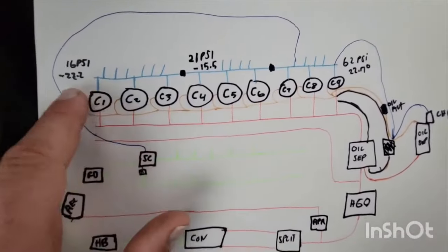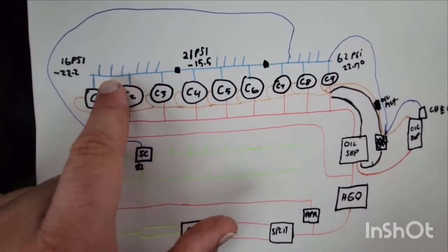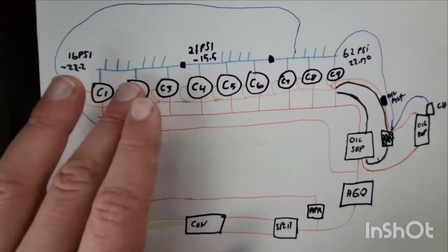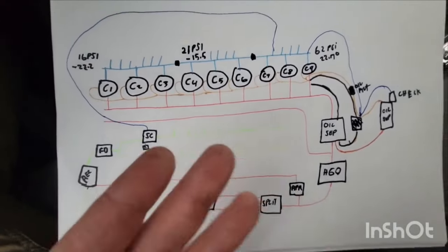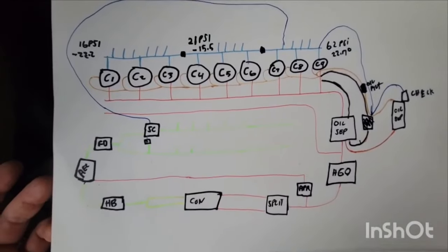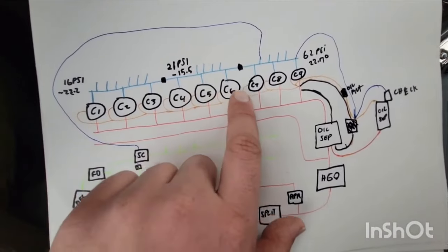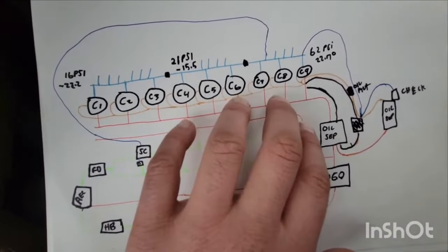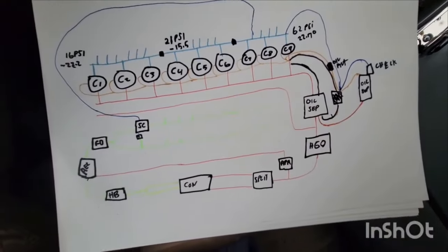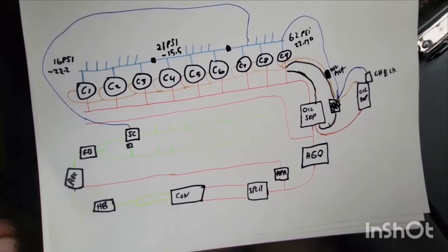So if you have, let's say, this 16 PSI suction group with a high suction, are all your compressors running? That's just first and foremost. And if one of them isn't, why? Same with any of these suction groups. If not, why? And that would typically lead you to the oil problems that we already overviewed.